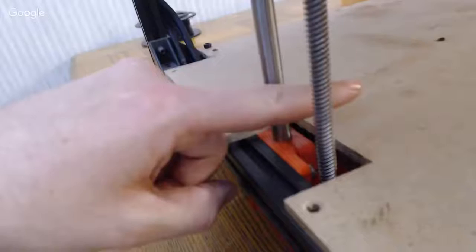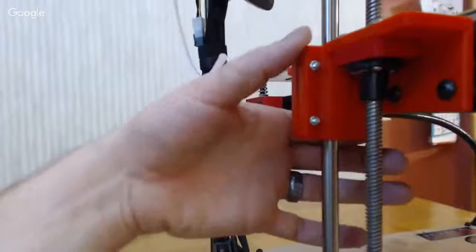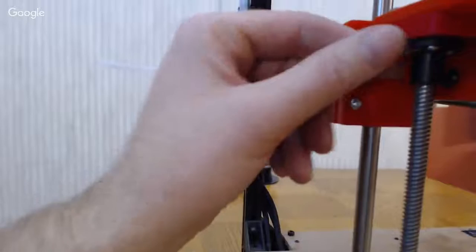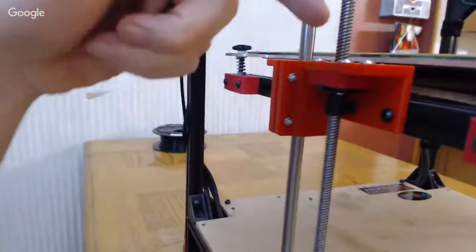Or if this piece here is a little bit fat, the Misumi guy cut this thing a hair long, whatever it is, it's going to end up putting tension against this rod and basically trying to force it into a bow. And then that can start putting and twisting, kind of a lateral force into the ball, into the lead screw or ball screw, which they tend not to like. And you can get that ribbing effect.